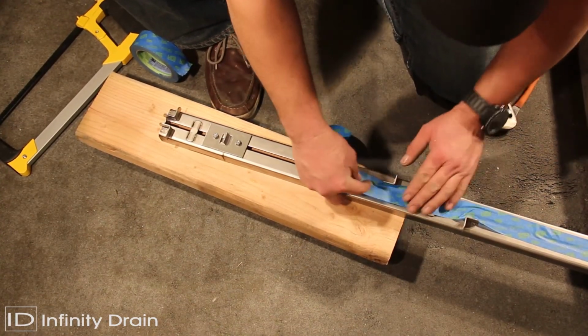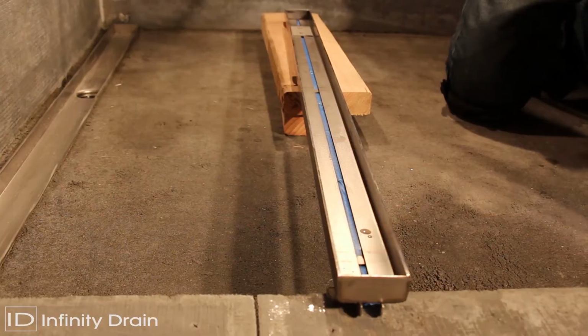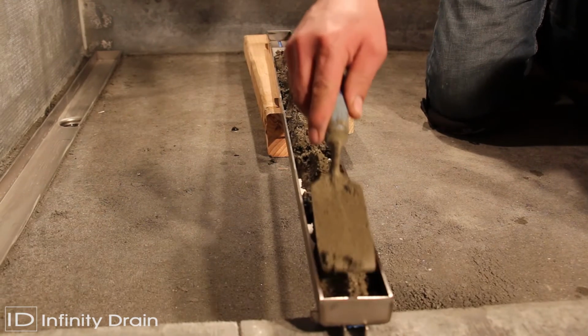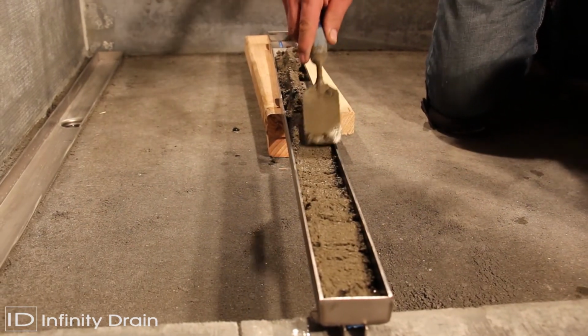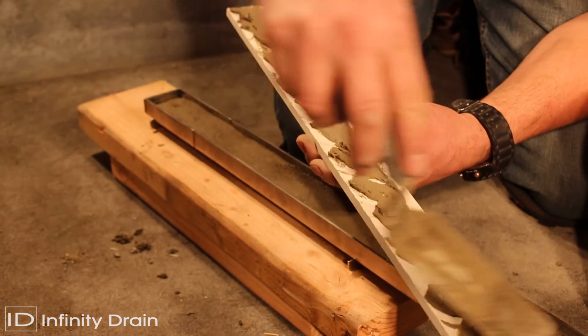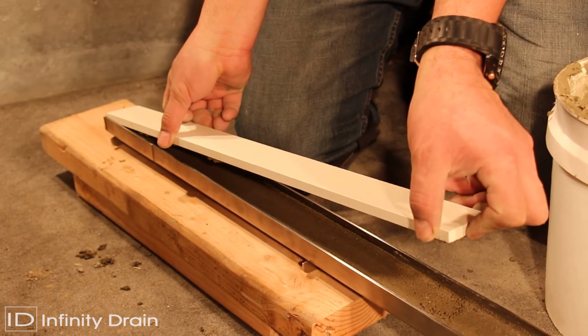Temporarily conceal the gap on the bottom of the TA65. When a finishing material of less than 3/4 inch is being used, the inside of the TA65 grate should be built up using mortar. Allow for the thickness of the thinset and finishing material. Once the mortar is dry, lay finishing material into the TA65 with thinset.